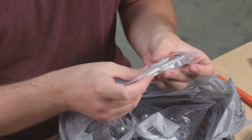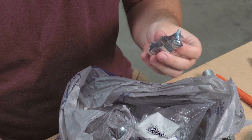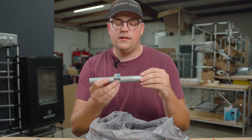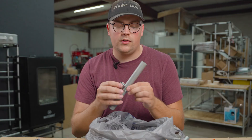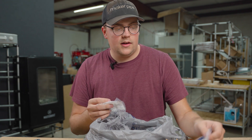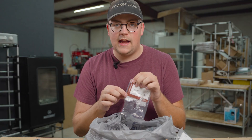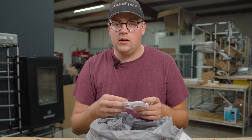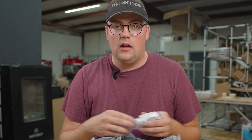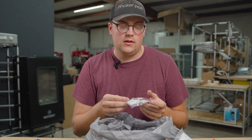Another accessory you'll find is a conduit hanger strap. The conduit goes inside the hanger, then there's a clamp — you tighten the bolt and nut, it secures on the conduit, and there's a hole that allows you to drill it into a wall or ceiling. It's similar to the one-hole and two-hole straps but is suited to specific situations. Worth noting: all the other accessories we've looked at came in blue bags specifically labeled for EMT conduit, but this one has a brown bag that says 'accessories' because it can actually be used with both rigid conduit and EMT conduit. So if you're looking for these things off the shelf, pay attention to both the EMT-specific items and the general accessories section in the electrical aisle.